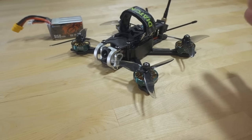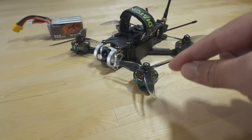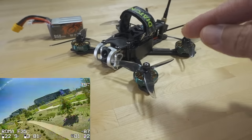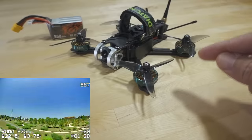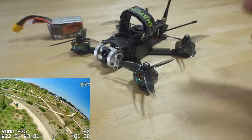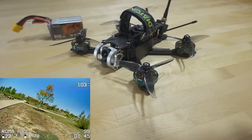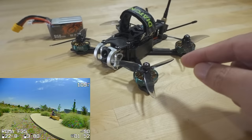The way it flew for me, at around 75 to 80 percent throttle if you go above that it doesn't seem to pick up any more speed, because even though the motor can spin this prop really fast, the prop is only three-and-a-half inches and can't really generate that much more speed. So in terms of efficiency, this 2203.5 motor might be better on a four-inch or even four-and-a-half inch prop. It's just under that optimal size of a traditional five-inch where you have the optimal power-to-weight ratio and speed. Yes, it's not optimal. Yes, it's going to be over 250 grams. But people like lots of excess power in the air and you're going to get that on this model.